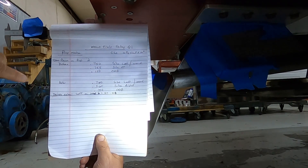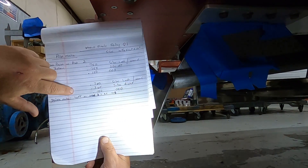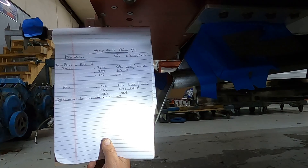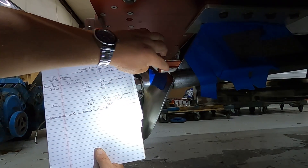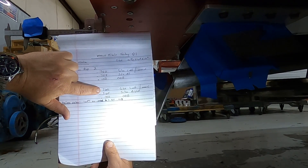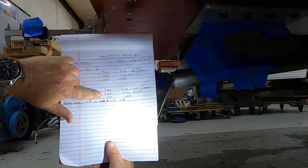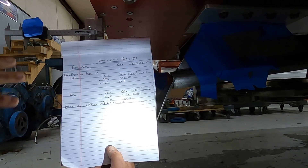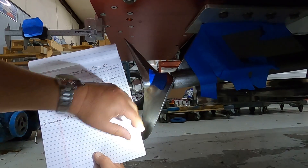That's before the run. After I make the run, I'll measure the prop again before I take it off the boat. You can see the propeller moved up 10 thousandths closer on each blade, so the blade stayed constant and the prop moved 10 thousandths closer to the strut barrel. You might also see one blade go to 0.765 and another to 0.760 — that's okay — but if one moved 30 thousandths and another only 5 thousandths, you may be seeing a weakening of one blade starting to bend.